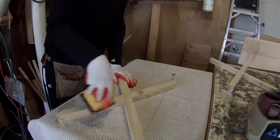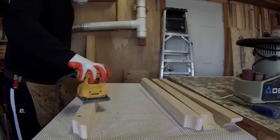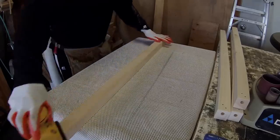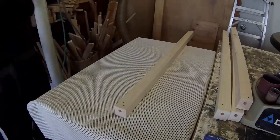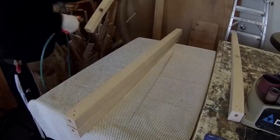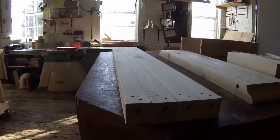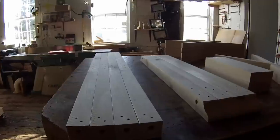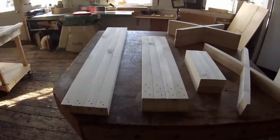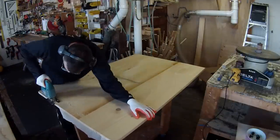This is 220-grit sandpaper and I'm doing a light sand on these — I'm actually not sanding all the saw marks out. In fact, I purposely used a dull circular saw blade on my table saw when I cut all these frame members because I want some of that circular saw texture to show on the finish. I want it to be rustic looking. I've actually never done that before for a stained finish. I'm leaving a little bit of the rough texture just to give it some character. Here I'm cutting the final size for the tabletop.